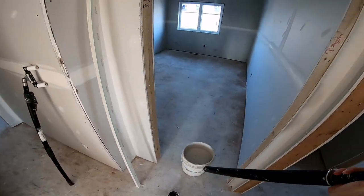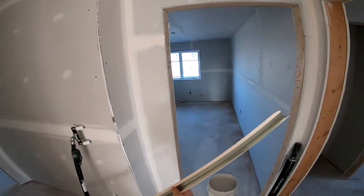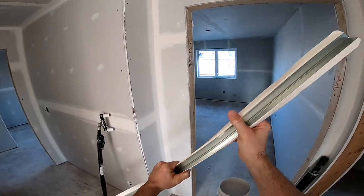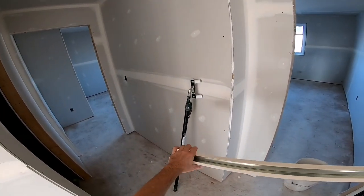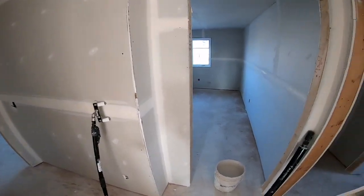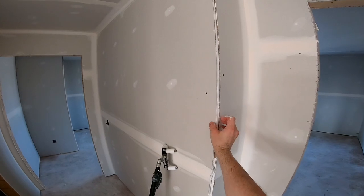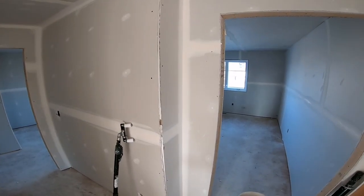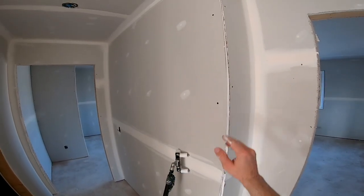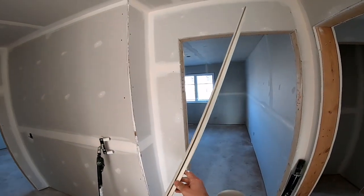The first and most important thing is you want to take your bead and fold back the paper flanges. For many years I never used the corner bead applicator because I'd get bubbles behind my corner beads — bubbles I didn't get when putting it on by hand. As soon as I'd use the applicator and roller, I'd get bubbles. Then I learned that if you fold back the flanges you won't get those bubbles, and I'm going to show you why.